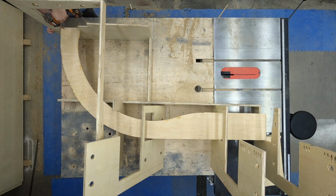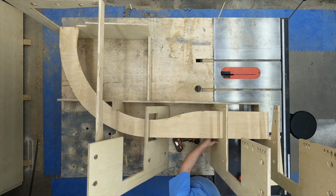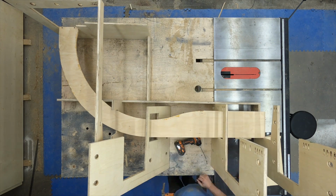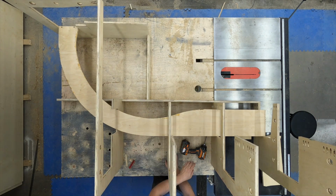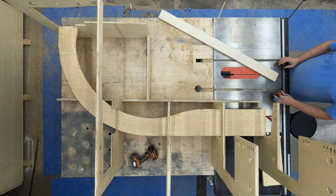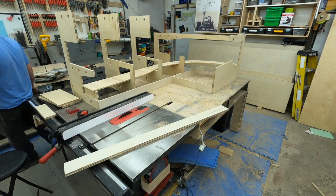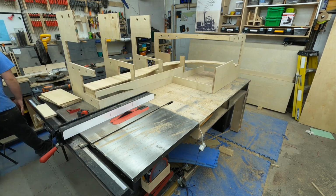So I've got the cross-member, the dual deck modules in place now. I did go ahead and put some through holes for the bottommost layer. It just happened to work out a little better to better support the middle deck, which is the 1/4-inch plywood sheet, to actually cut a hole versus cutting a slot like the far left-hand side piece has. And long term, again, it's going to make for a stronger module. So I just want to make sure that everything holds together well, not just when I deliver it, but 10 years, 20 years from now.